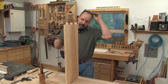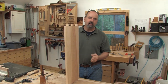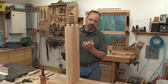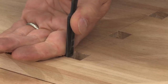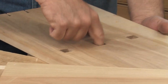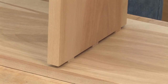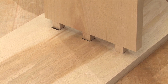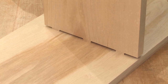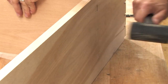I've got the joint where it fits going in from the outside a little bit and coming in from the inside a little bit — not all the way through. This is really common; typically it's because those mortises are slightly offset. The natural thing to do is to work from the inside until the joint fully seats, but the problem is you're going to create gaps at the outside of the joint exactly where we don't want them. Here's the trick: fit the shelf from the outside in. Once it's fully seated, you can rotate it around and put it in the proper direction. It's going to look really nice from the outside, and on the inside, where there are any gaps, they're going to be hidden by that little shoulder we cut on the table saw.